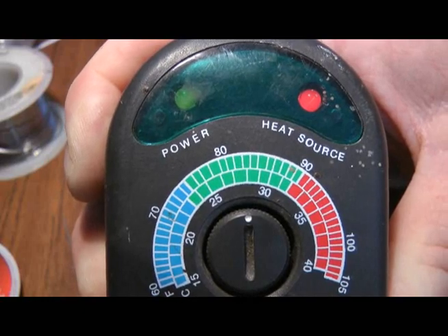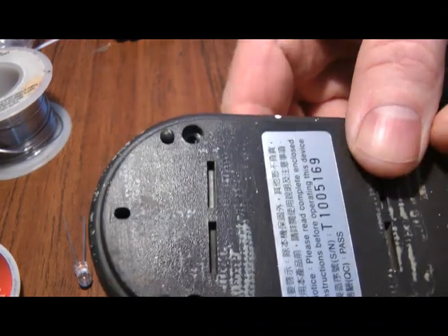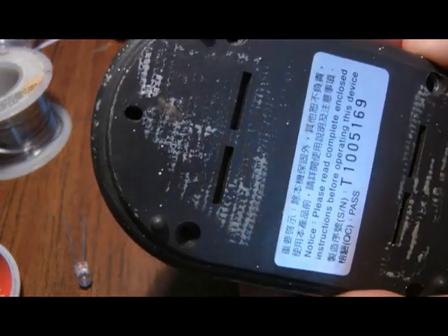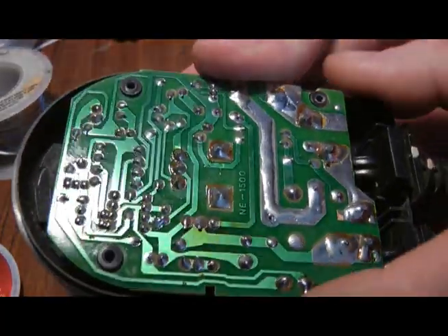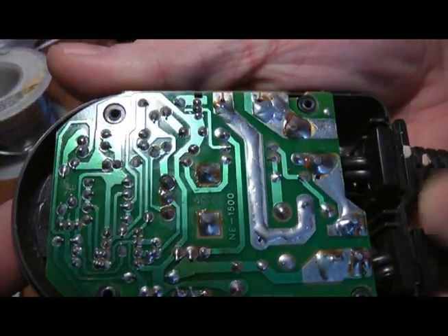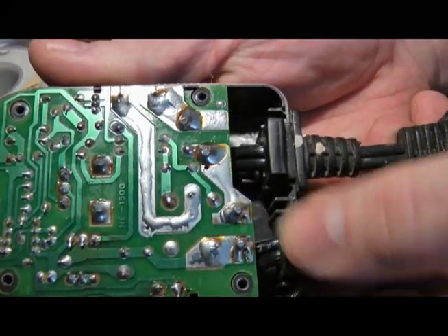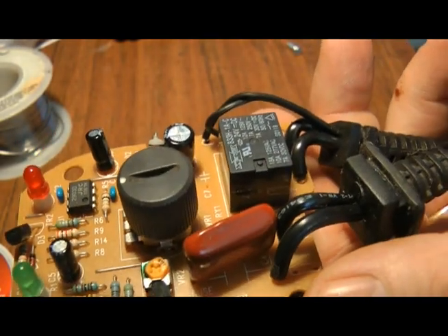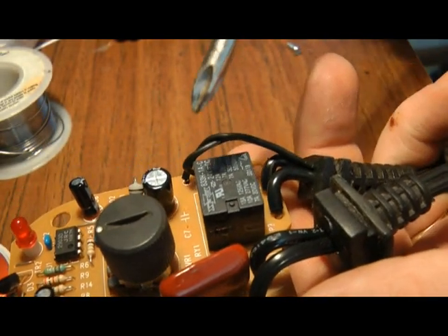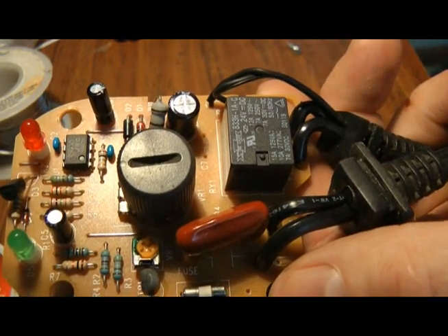So the first thing you do is unplug it — lights go out, unplug the thing. I've already taken the screws out, so pop the top off the back, pop the back off the back, and pop the assembly out. There's two places down here where the molded cords are molded into the body of the thermostat, so you take those out very easily. And when you flip it over, here is the component that we're interested in changing out right here — this relay. I have never changed this one out, I don't believe, so it lasted a long time.